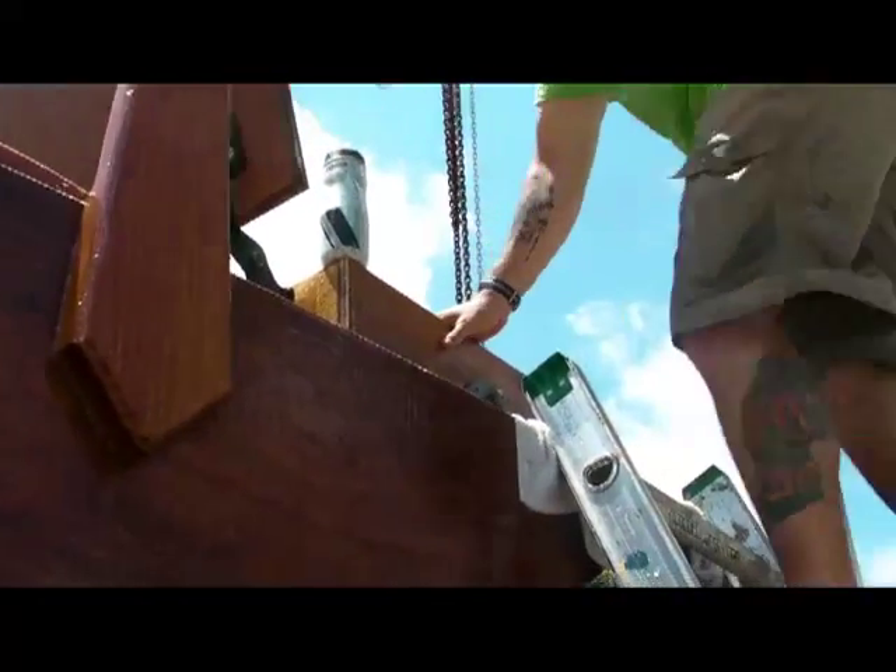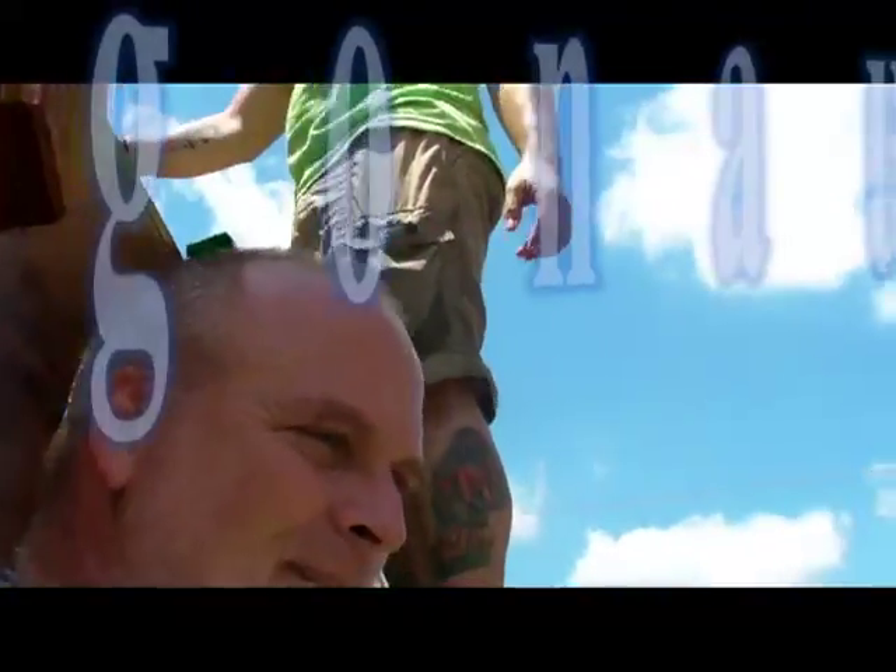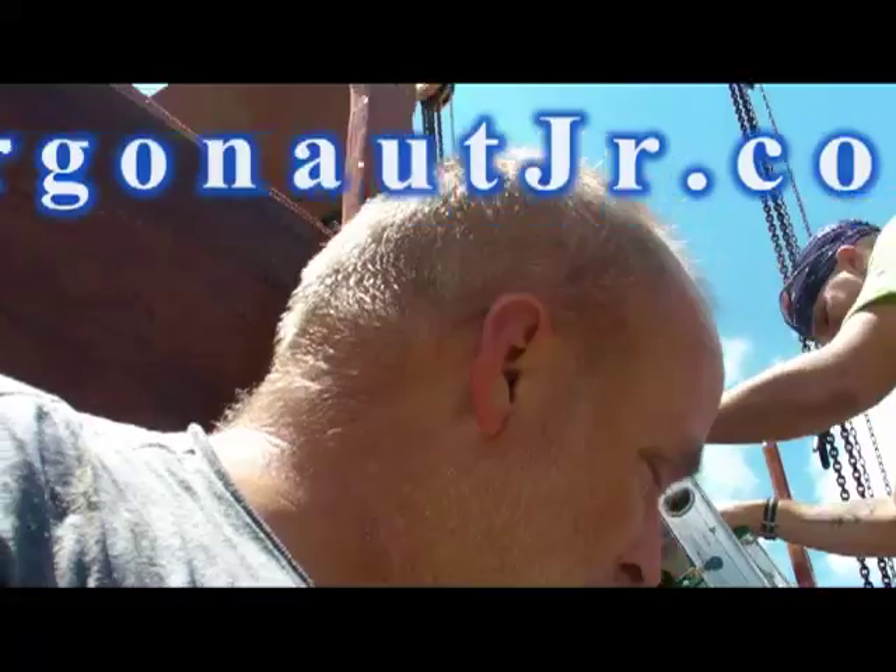I usually do one side simultaneously - it seems to work fairly well. It seals good. Alright, let there be daylight. There's no seagulls to greet us as we open the hatch - sunshine coming down. We got pressure into the main ballast tanks and let a little bit of it off on each of them. Now we're going to let it sit for 30 minutes and make sure all four of them still have pressure. Everything so far looks dandy. Bottom check valve worked fine. Looks like we'll be blocking her up and heading to the lake.